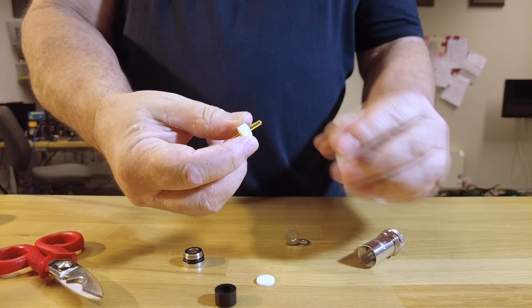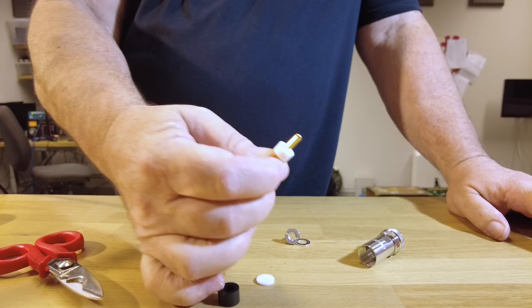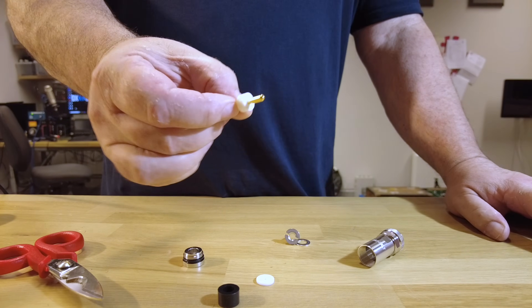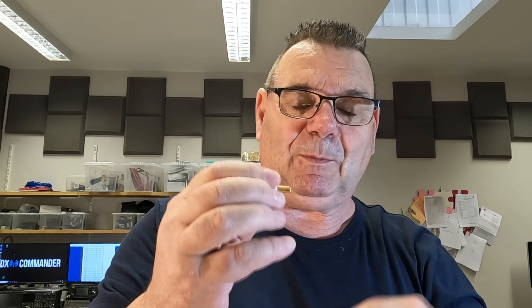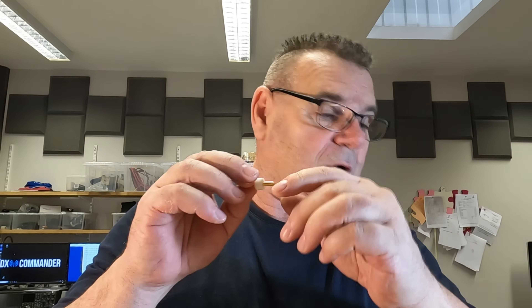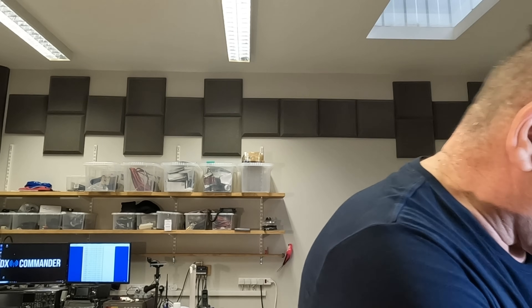Some people call these a four-millimeter shielded banana plug - frankly I prefer that description. HF works absolutely fine; there's plenty of surface area. For UHF and microwave stuff you'd use N-types, which look on the surface quite similar but have a different pin.